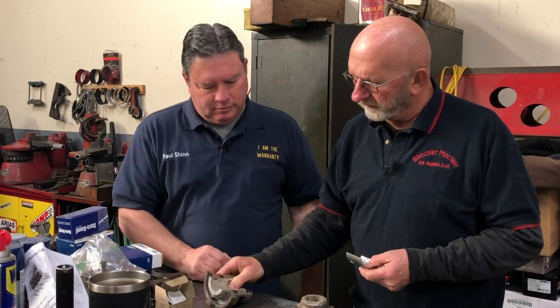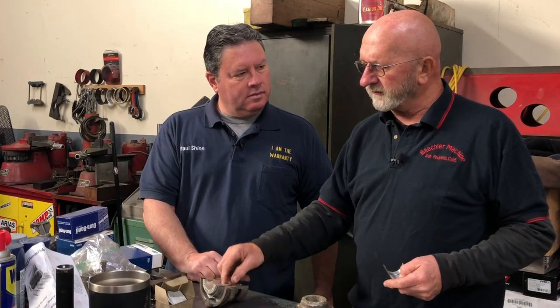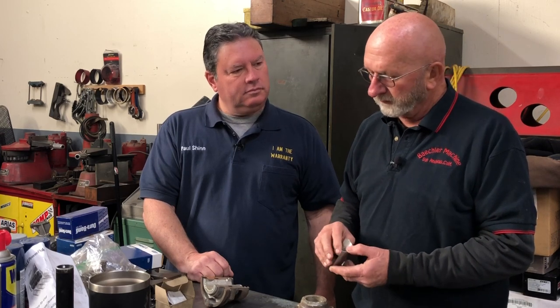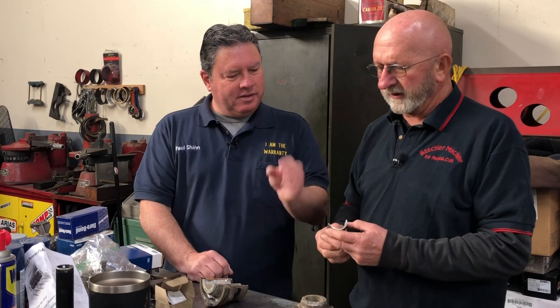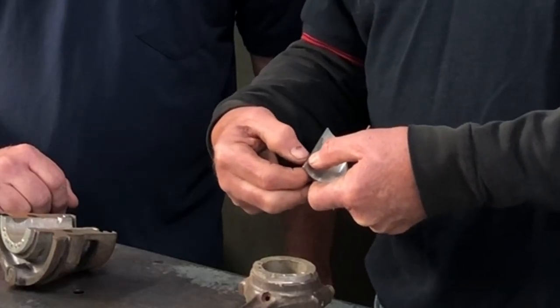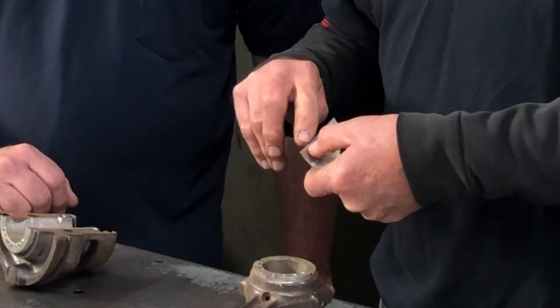If you're looking at the Babbitt, see how thick it is here? This gets machined out to maybe an eighth of an inch of Babbitt, where the steel shell is an eighth of an inch thick steel, which has better strength. The Babbitt is poured into the steel shell. So the insert still has Babbitt — it has tin — but it's just a thin coating, about 20 thousandths thick. If you look between my thumbnails right there, that little silvery look — that's the layer of Babbitt.